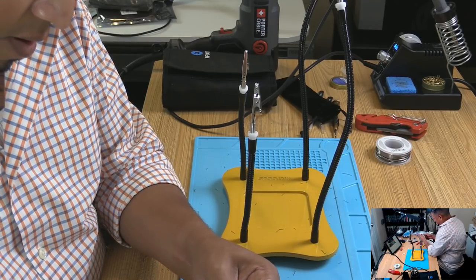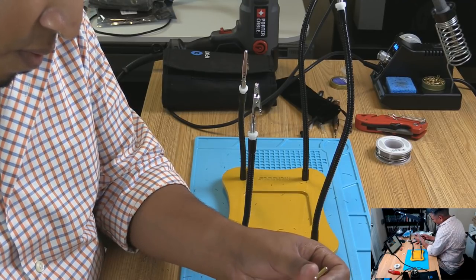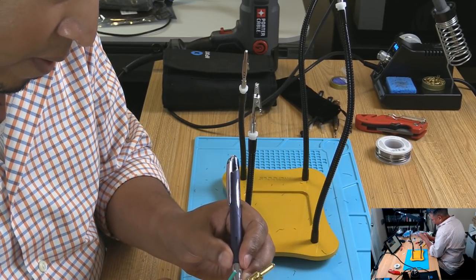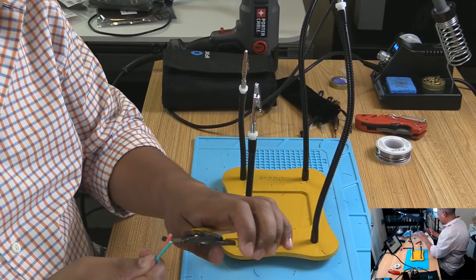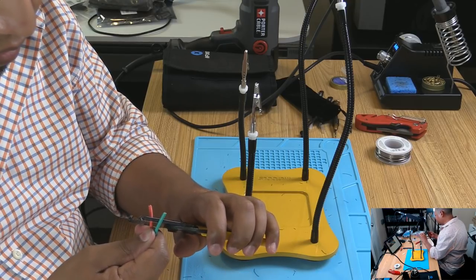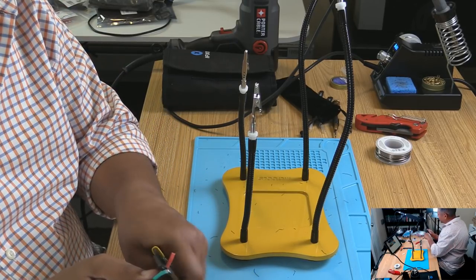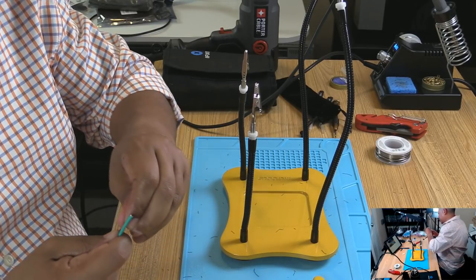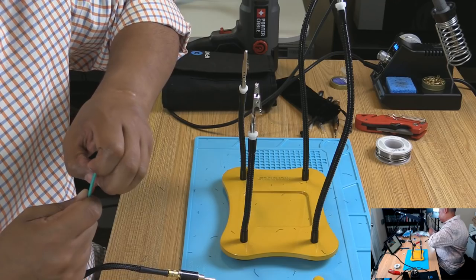Okay. Now I know how much to strip. Let's start stripping. One gauge bigger, so from 14, I go to 12. Quarter turn. Now we go one bigger than that, which is 10, to try to release it a little bit. There we go. Pull it off. There we go.